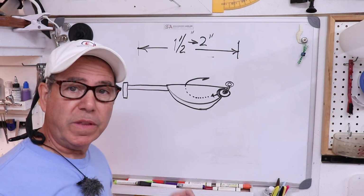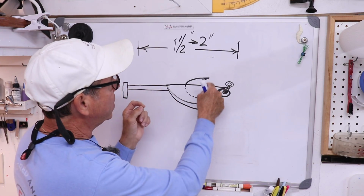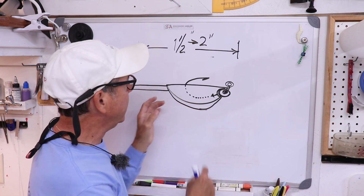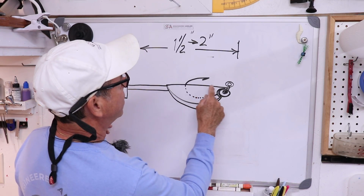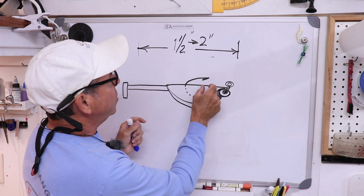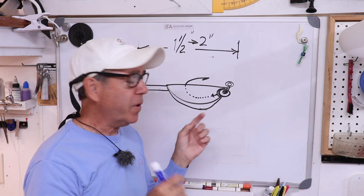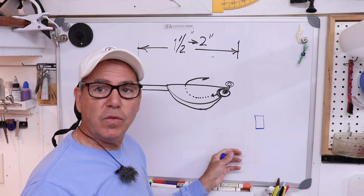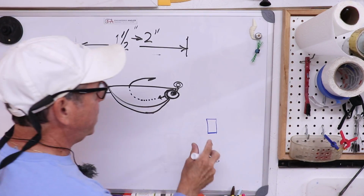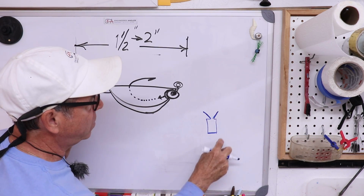So before we get started with the mold box, we gotta kind of design the mold box. And you wanna know where you wanna fill in from on your lure or whatever it is you're pouring. So I wanna fill in from the very top, this flat spot, because after I unmold it, there'll be a little piece of waste rubber there, and I can slice it off with a razor blade and it won't show. I'm gonna use a small piece of CPVC as my center reservoir, and a sprue going through the top so I can fill it, and then I'll arrange the little minnows around it.